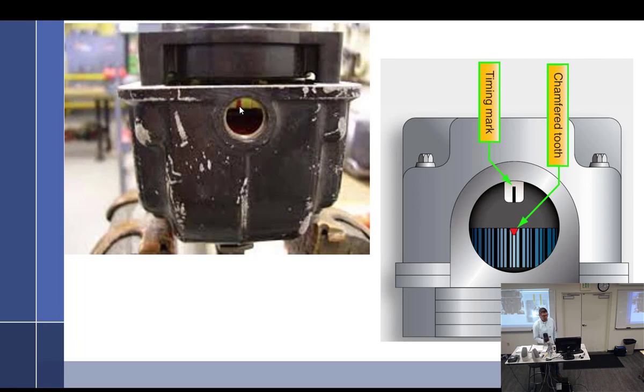Ready to fire which one? Number one cylinder. And for those of you who built it, you know that there is a neutral position where it won't rotate. It locks in. What's the problem with the red tooth in the neutral? They're 10 degrees offset. So when I put this in the neutral position, where the magnet holds it in place, it is going to fire 10 degrees later, pretty much. So if I put it in the neutral position where it's held nice and still, I'm 10 degrees off from where it should fire. So if I turn it just for that little red tooth in the window and let go, it won't stay. So there's your problem.